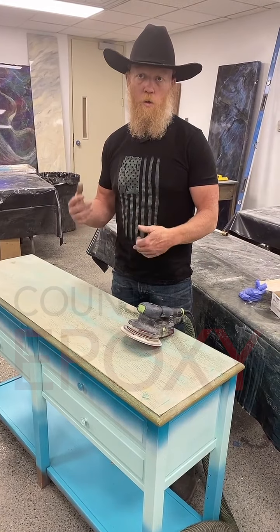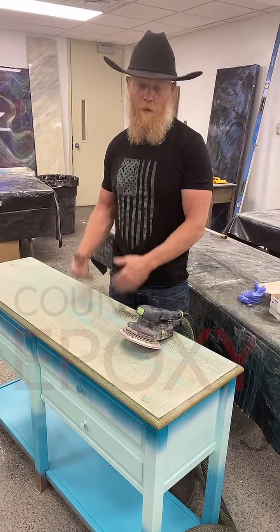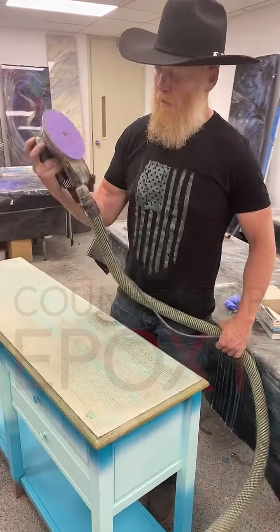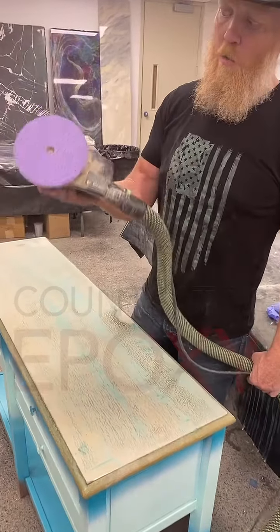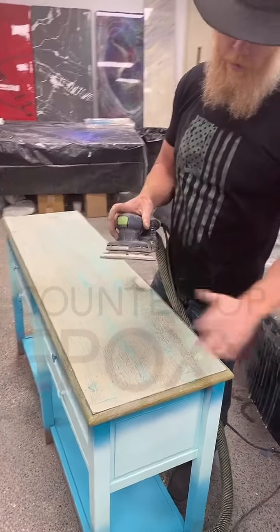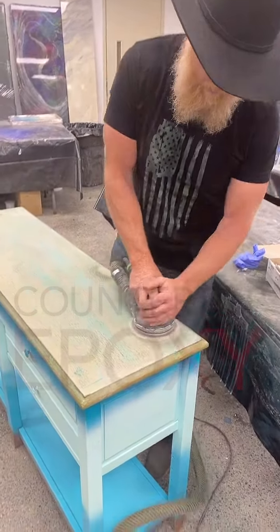As I polish it, I'm hoping I have a polished brass wood grain popping out of a light turquoise. So maybe my communication sucks, but hopefully my sanding skills don't. So I am starting out with 320 on my Festool right here. I have a pretty firm backing pad because I am trying to cut any highs off and profile.